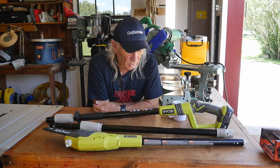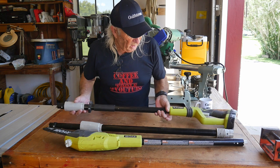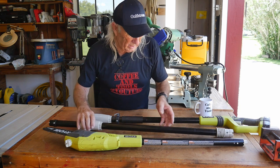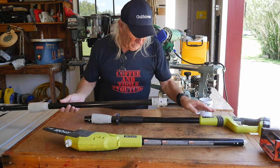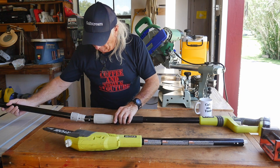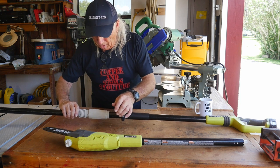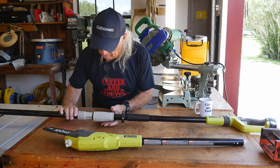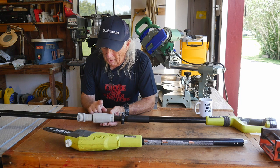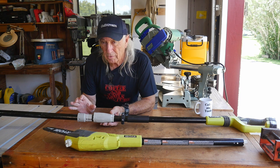So this is the situation here with the Ryobi — it's the same thing over and over again. This is a 10-foot piece when it's all put together. These collars are plastic, and this one here from the trigger — we'll call this the male end, this is the female end — they plug in and you tighten the collar up. The problem is these break. Usually it's the female end I see missing or broken; this one had the female but the male was broken, so I took a look at the idea of making one on a 3D printer.